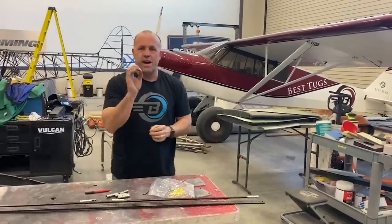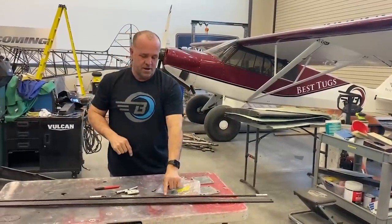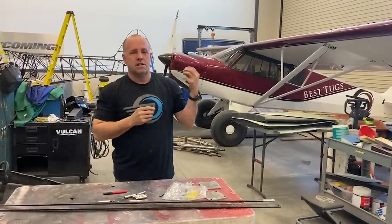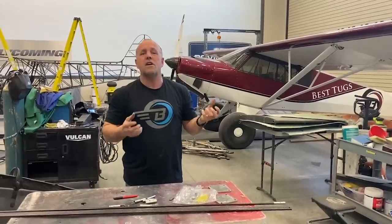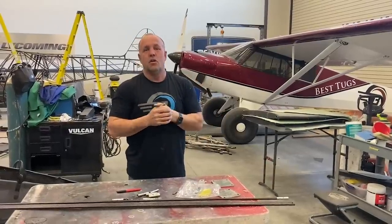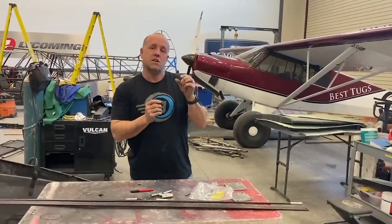The reason for the threads is it gives just a tight, tiny point that actually comes up and barely grazes the carbon fiber. And that's to get the metal, stainless steel, away from the carbon. Now, stainless and carbon actually work fairly good together, but you still can get a corrosion caused by carbon and any type of metal. Aluminum is really bad, but on this one, I wanna get that stainless steel away.